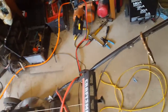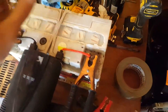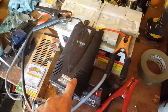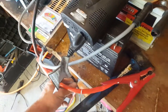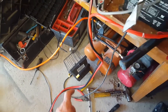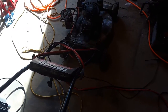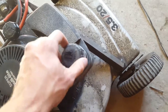I'm just gonna run it. I'm gonna hook it up to this battery here. You can see the booster cables. This other one is just the voltmeter so I can see it, and then this inverter is hooked up and plugs into this inverter. There is a 300 watt halogen light that will represent a 30 amp load, and this hasn't been started in a few months so let's see how it goes. Let's see if we have any gas — yep, we got gas.